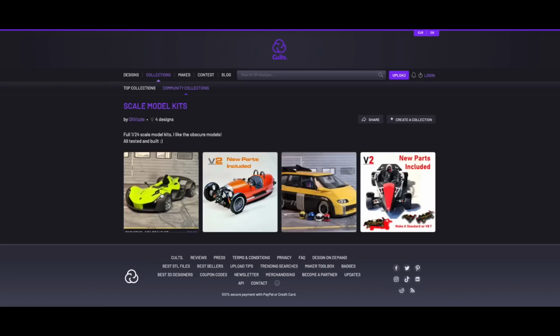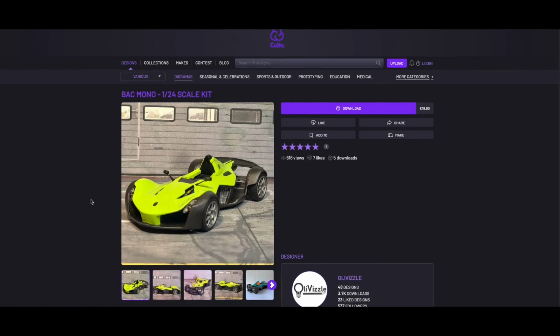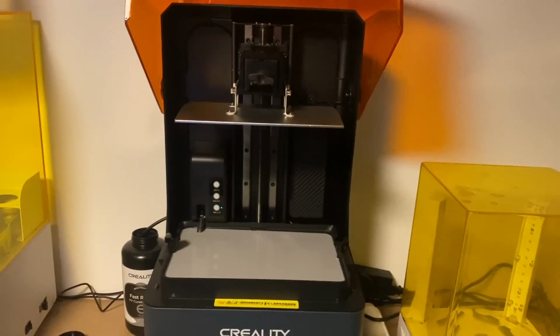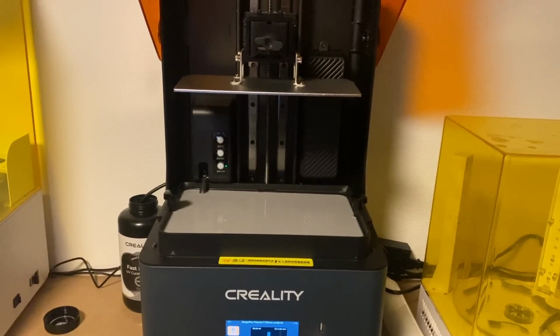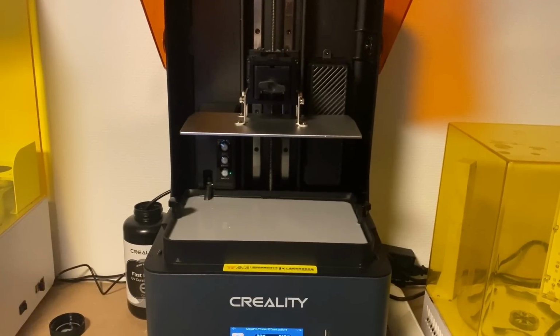and you could also go to Dynax mode Plus to go even faster and have the UV resin specifically for fast printing in there too. Otherwise it will give some problems as the resin is too thick and it can't really handle all the material going too fast and therefore giving failed prints, so be sure to use the fast resin.